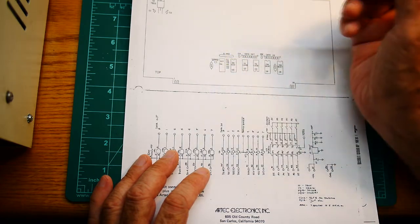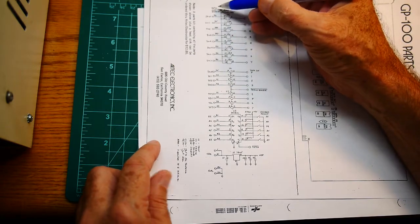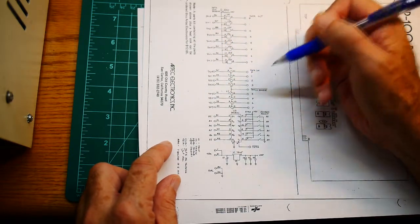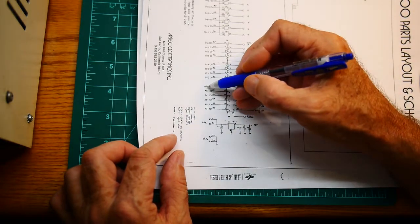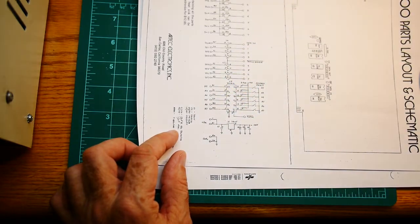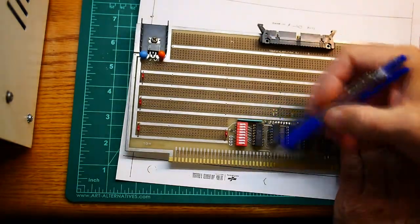So again, low logic match. Here's the schematic — for data coming into the board there's a high logic enable for that. And for data going out of the board, there's a low logic data enable. Then there's a comparator that's looking at A2 through A7, and if the switches match the inputs it generates this not-match signal. That explains this much of the board. Those are all standard with the board, and I've added two chips for the Centronics interface.